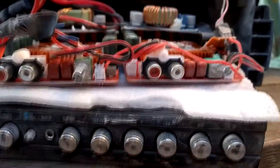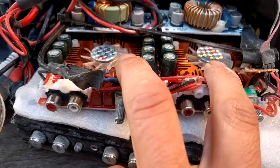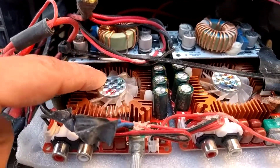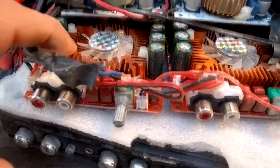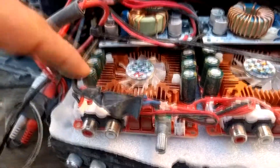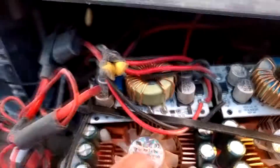Effectively you've got four amplifier channels — the bass is mono but there are three outputs. I'm using two separate stereo amp boards at 160 watts per channel, with a fan built in. These will run off all sorts of voltages, but you want to run them at high voltage, so I'm running them at 35 volts — the maximum, limited by the chip and the 35-volt-rated input caps.